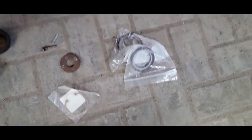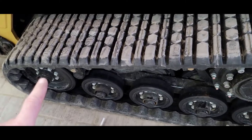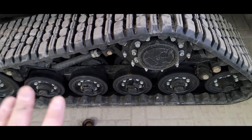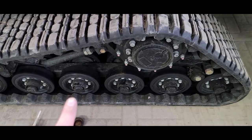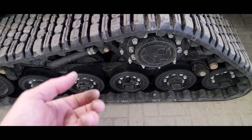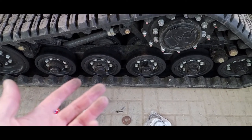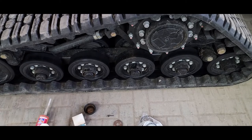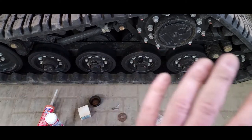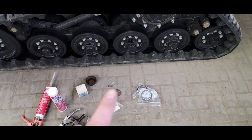Use good grease on your bearings. I think ASV made a mistake going to these newer wheels, and the cons are that the parts are much more expensive — when you have to replace bearings, seals, and if the hub is corroded, that hub is fifty bucks. The original wheels only had a seal, two bearings, and maybe washers if you'd thrown them out. To me, it doesn't make sense upgrading these wheels on the older machines. The original ones just weren't designed right the first time, but by doing this fix you're going to thank me in the end, I think.